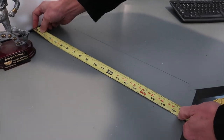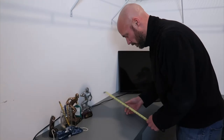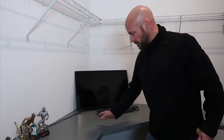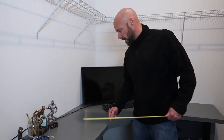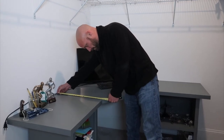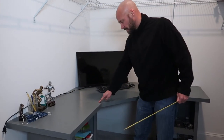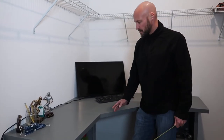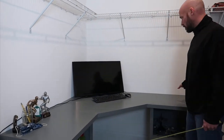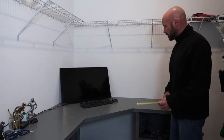That's minus the trim work from the front, so if you're cutting this raw that's what you'd cut: 19 and a half by 24. You can go bigger, but when you line everything up you want to make sure that when you cut your triangle or diamond for the corner it matches that 19 and a half inch dimension. There are two of those — one on each side — basically a mirror image.